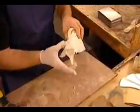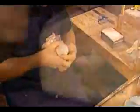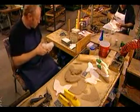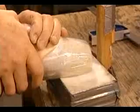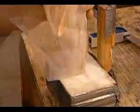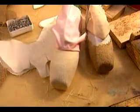Now the final layer of fabric, a piece of pure cotton. They wrap the toe box in plastic wrap to keep the hammer clean as they square off the front, creating what's known as the platform. Then they press the toe box onto a piece of marble to make it completely flat. They verify that the platform is perfectly square. If not, the ballerina will topple over.